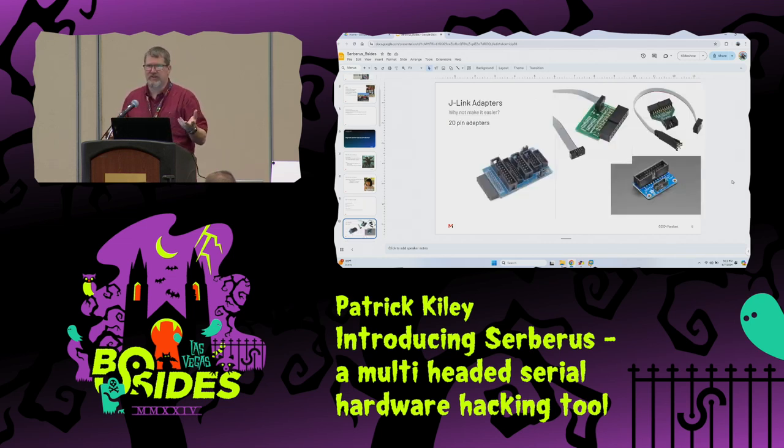Anyone who's actually used a Segger J-Link has seen one of these adapters. You're moving from your standard 2.5 millimeter pitch device down to some really small connectors, because your typical Cortex debug connectors, you can see down here in the lower right, have a really fine pitch and use these really tiny ribbon cables to connect directly to the device.